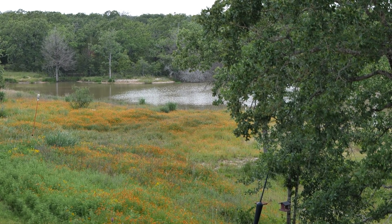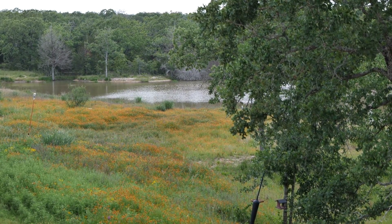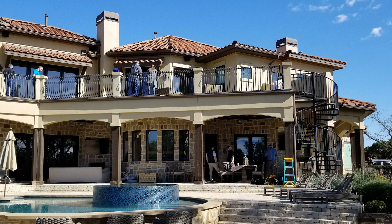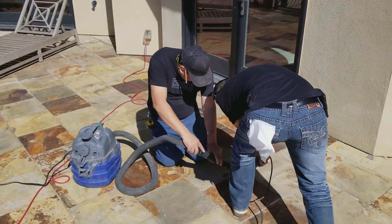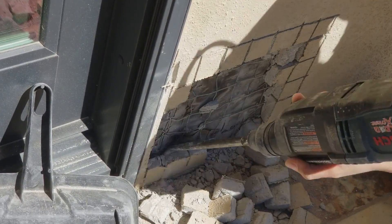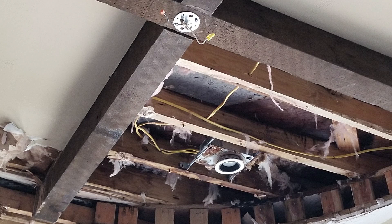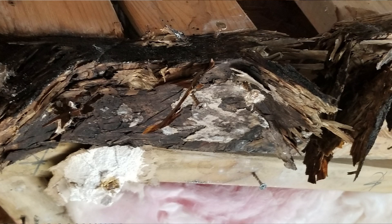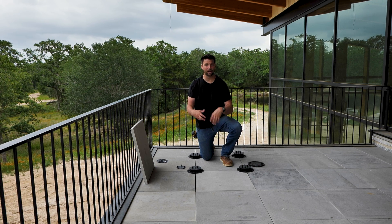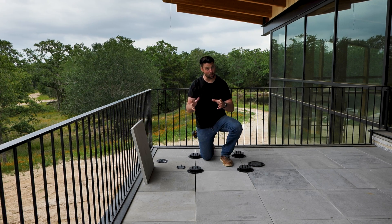We've done all of this stuff to make sure this roof doesn't leak back between the wall and the roof, and we make sure we have good drainage that goes down to this gutter and then drops down this exterior wall. But we don't have a floor on it, and that's the point of a balcony. What some people will do is just put tile directly on whatever membrane they're using, and I don't like that at all. I've seen it in multi-million dollar houses on the lake where the balcony is leaking down into the house and they're having to tear up everything and do extensive repairs inside. We don't want any penetrations and we don't want foot traffic directly on our roofing membrane.